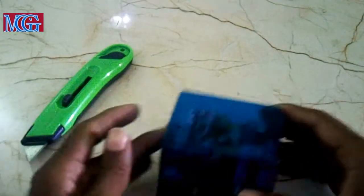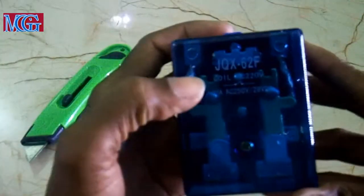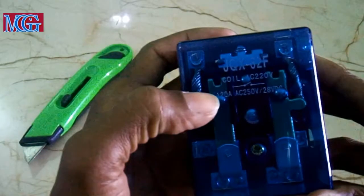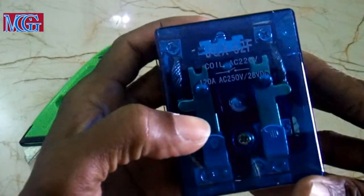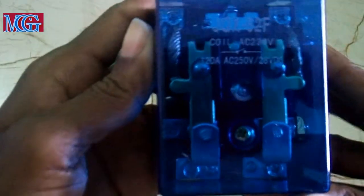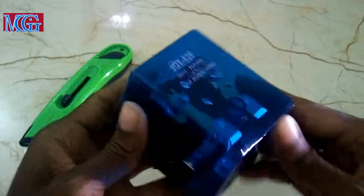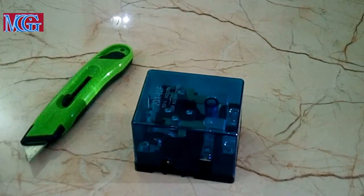This is like live — I'm recording. What the wrapper shows is that it is 12V DC, 24V DC, 110 AC to 220 AC. But now when I get inside the package, the information I see directly on the coil is telling me it is a 220V coil. That means it needs 220 power to run — not 12V or 24V DC, which is what I had. So I'm not getting any of those options.